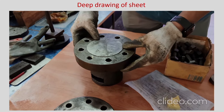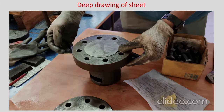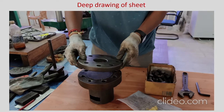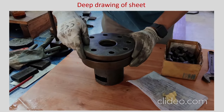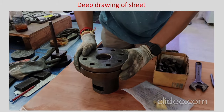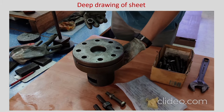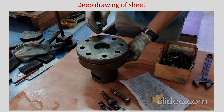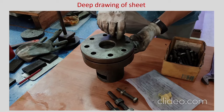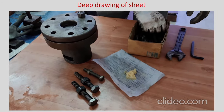The sheet is placed coaxially — it should be exactly at the center. One difficulty is that we cannot see the deformation and the sheet can slide, so it may not be axisymmetric while deforming — one has to be careful. You are going to place a blank holder ring. Blank holding here is done with mechanical fastening instead of hydraulic gripping; you put fasteners and tighten them to give a blank holding force on the sheet.